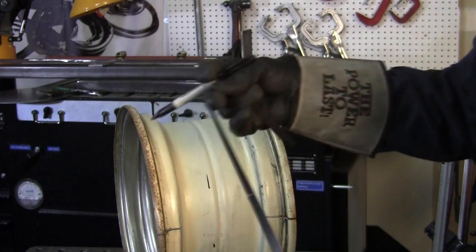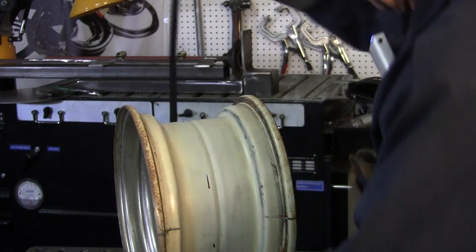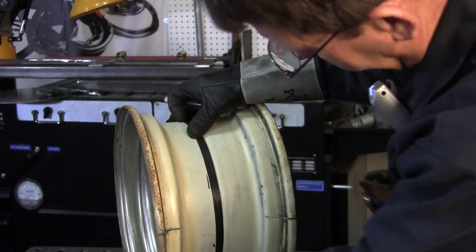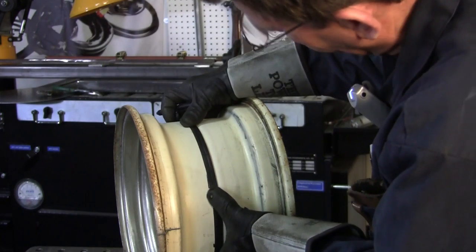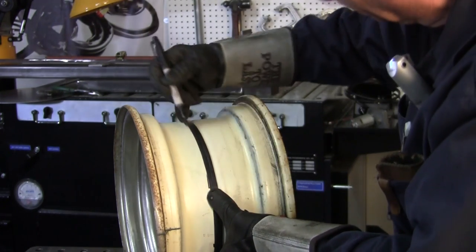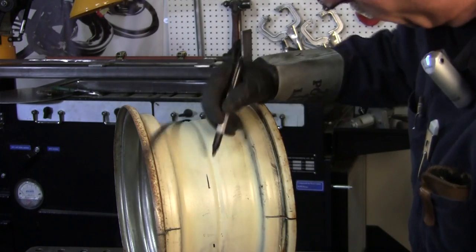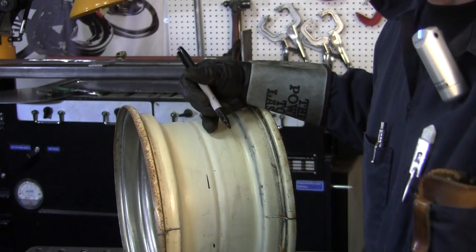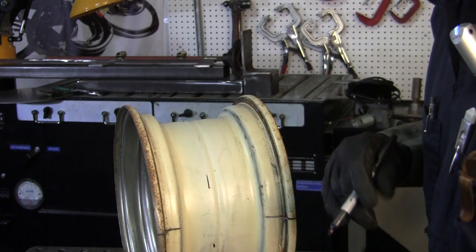So we've got our marks — now we want a straight line. I've got a little piece of plastic banding material; you can use anything, even a string. Line up some of your marks just like that — that'll keep you on a nice close-enough line. I throw a couple pieces of tape and make our mark. That way when you cut it, you know you're not going into the seam. If you cut too little, just grind it off.